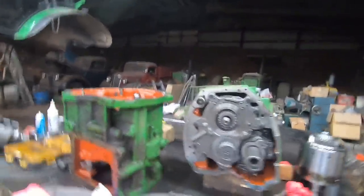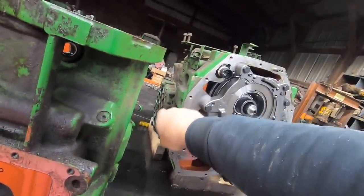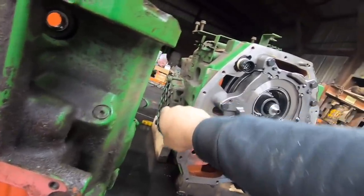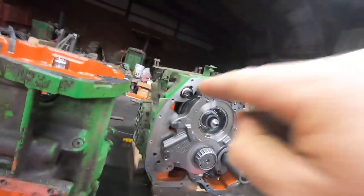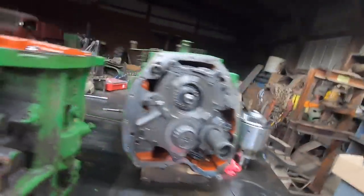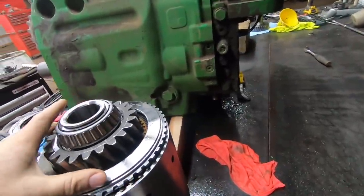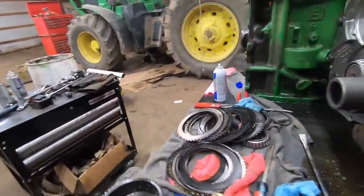He says there is a slight chance that one of the O-rings inside that plate, where the solenoids are, that particular part there, has a leak. Even though the pressure test came out correct, he says it could be that there's just a slight leak and they're slipping a little bit, which causes wear. And that was really kind of what I was thinking myself as well.